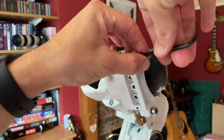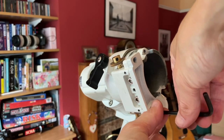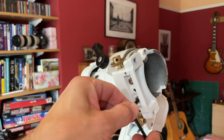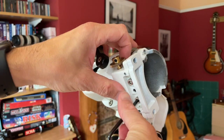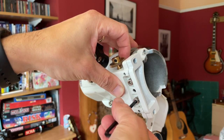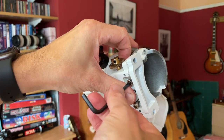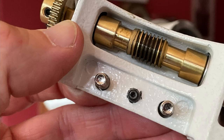What we're doing now is just removing the worm drive from the declination axis. There's a couple of 4 mil bolts on the top and a couple of 4 mil bolts beneath that actually attach the worm drive onto the mount. You'll also notice there's another allen bolt in the middle — whatever you do, do not change that. Don't rotate it or anything like that. That's used for worm drive adjustment later on, and when you're adjusting the worm drive you're basically making sure that these three bolts are getting the worm drive as close as you can without there being any play. So it's quite critical that you don't modify that middle bolt.